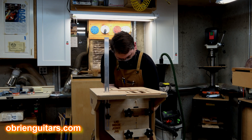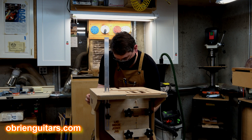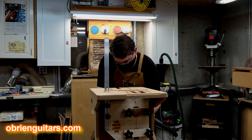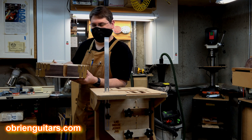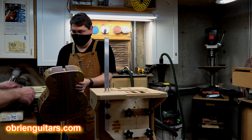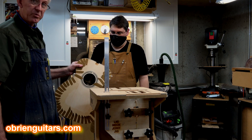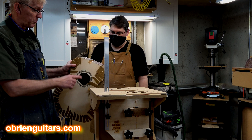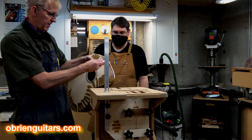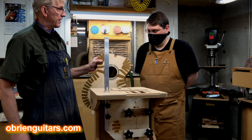Loosen a little bit, loosen your other side, pop it out of there — should just slide right out the bottom. Look at that. We're pretty committed at this point, folks. Now, if you happen to cut it off your center line, don't let that happen to you. Also, don't cut it too shallow or too deep. We're right at 22 millimeters, which is 7/8 of an inch. That's half the battle. Now we're going to turn this thing around and do the tenon on the neck — this is where this jig really shines.